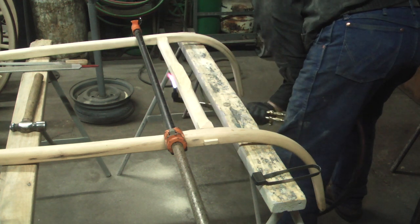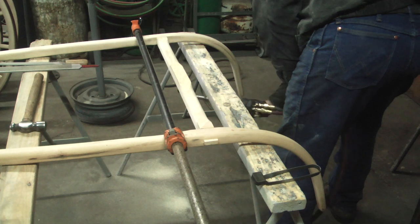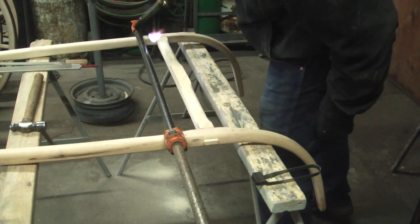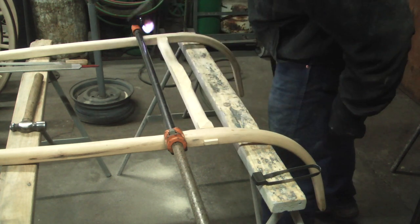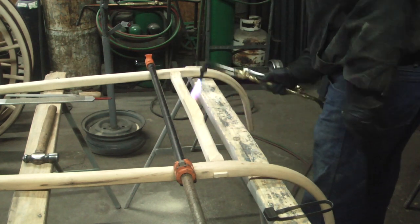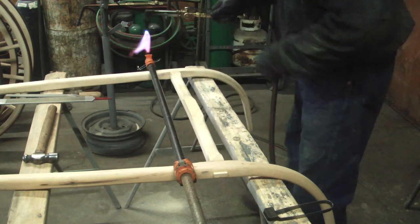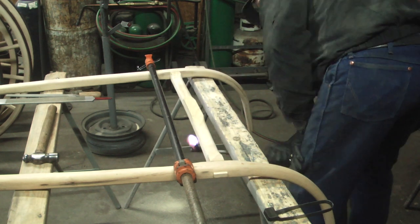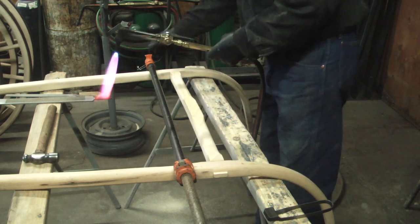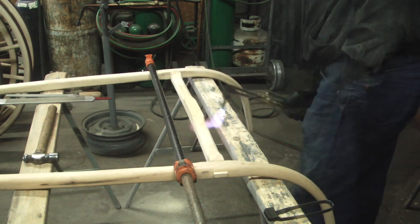My first goal is to bring that 22.5 inches between the tips down closer to 20 inches. And because wood has spring or elasticity to it, I'm going to bring it down to about 18 inches. So as I warm this crossbar up I'm going to occasionally add pressure to the clamp, which is going to cause a bow to go into the crossbar. This way I only have to bend one piece of wood to bring the tips together, as opposed to bending both sides of the shafts.